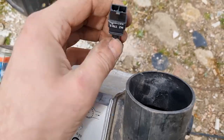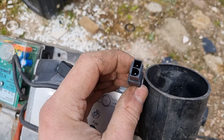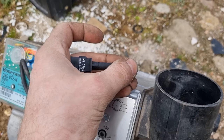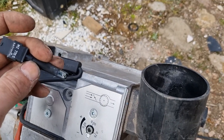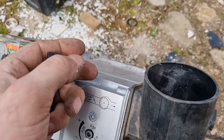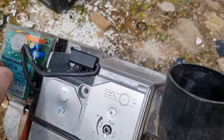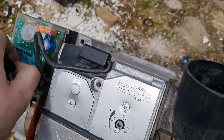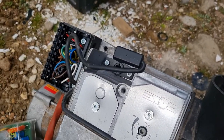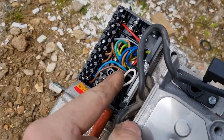Just your two pins on there onto your multimeter, testing on ohms for resistance across your circuit. This one's a fairly modern one — some of the older ones have just got two leads coming off the back. And if you needed to convert that, you obviously get your plate and your lead, but you just go into your control box and trace your wire back — it's just the ones on the far left on this.